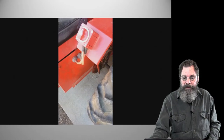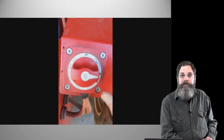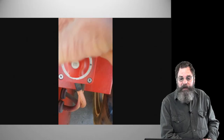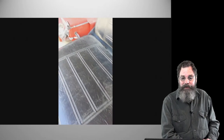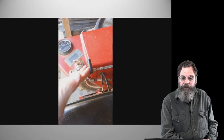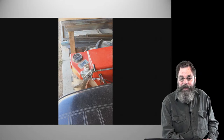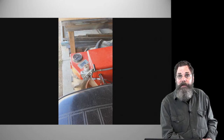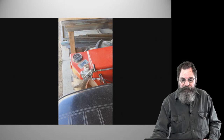That one, I think, is sort of a walkthrough on our controls. That's the marine two-position switch I talked about. That's our fail-safe disconnect between the batteries and the motor in case of an emergency or anything you don't like about it, shut it off. There's the throttle and the shaft I have to control, the little pot box, and then there's the ammeter at the top. The round gauge is the ammeter, and the square gauge is a digital fuel gauge, which essentially is reading the state of charge on the batteries.